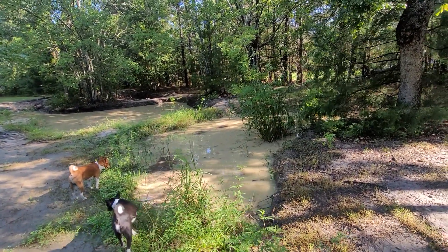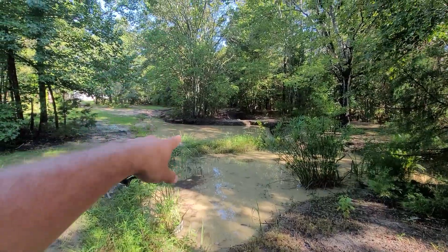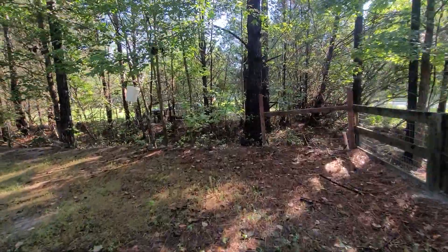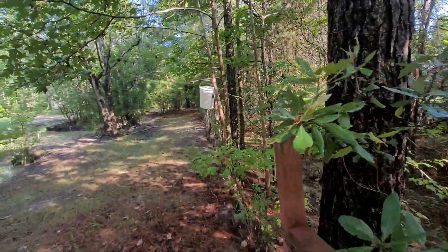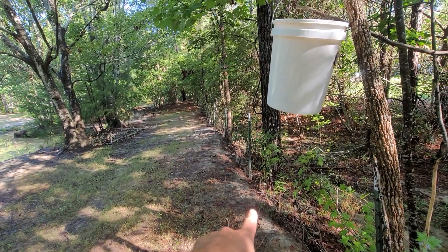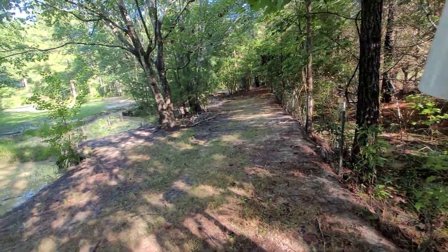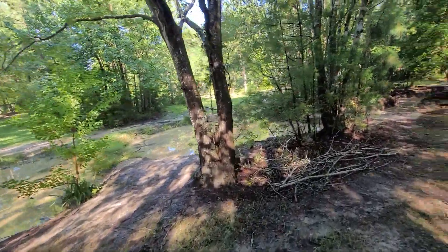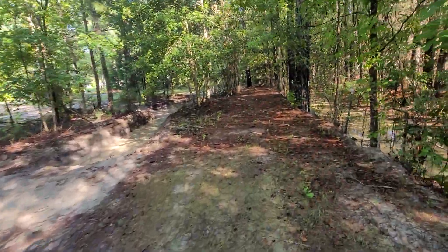This bog is actually really shallow — probably only two feet deep — and usually the water evaporates within a few weeks if there hasn't been any rain, whereas the pond takes a little longer. This has been part of my expansion pond project I've been working on the last couple of weeks. This is the actual drainage corridor between me and the adjacent property. It's a pretty wide corridor, not really that deep. These posts are four-foot posts, and I've graded my lot up so we're about two and a half to three feet higher in order to maintain all of the water on my property, because I have the largest retention pond to hold this water in case of storms and flooding events.